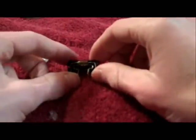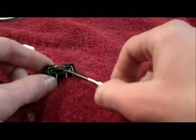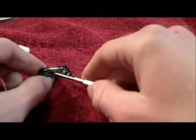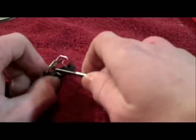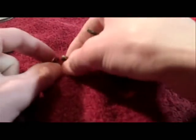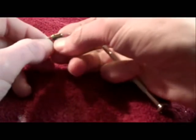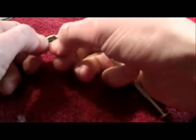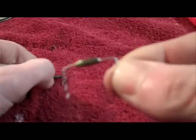I'll pry the plastic casing apart — it's just got these little tabs on either end. So that is the thermal fuse and resistor assembly. It's got these little wire guides in there that are holding the two pieces in. You want to be careful with the resistor because we're gonna be reusing that. Pop this out. Now we've got just the fuse, and it's got this little copper-colored clip on it. We'll just get that off. There we go. Now this is the 15-ohm resistor — I'm gonna save that. And this is the thermal fuse.